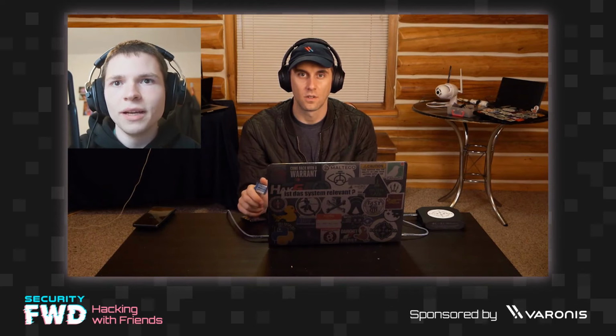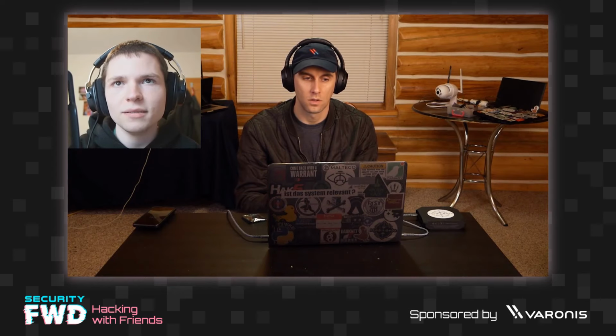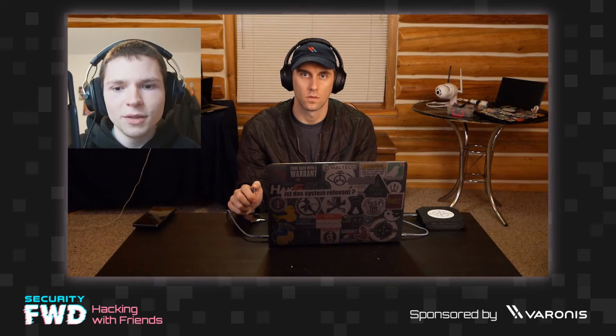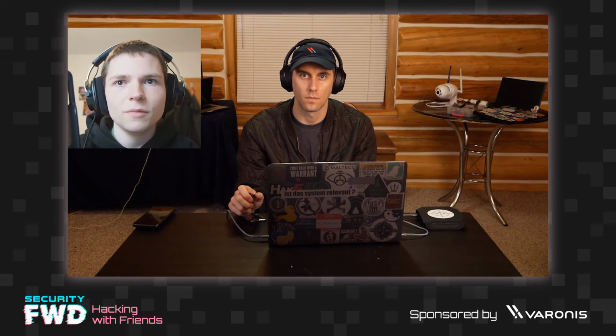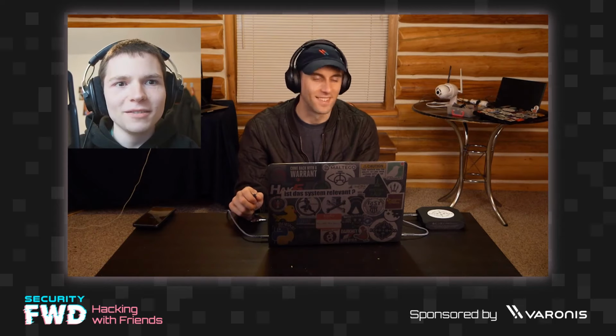as we said, the ESP32 has more power, so it's better for getting more packets, because it's easier to lose packets on the 8266 because of the limited memory, and there could be a lot of packets floating around in the air. You might lose some. That's probably what we are going to see today as well. We have to see if we can filter it or something to get the results we need. On the other hand, you, Kody, live in a remote location now, so I guess it's less of a problem than it is for me, for example.